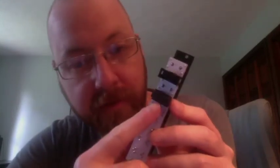But all you got to do to put these power filtering caps on there is attach them from the middle pins on either side of the IC, right? So this is a 14-pin thing. If you count 1, 2, 3, 4, that's one of them. And then on the other side, 1, 2, 3, 4, that's the other one, that's positive and negative voltages. You just want to connect a capacitor from one of those to ground, and then from the other one also to ground. That cleans out any noise that might exist in your power. You probably won't notice a difference whether they're there or not, but you should do it because it'll be better, if only slightly.